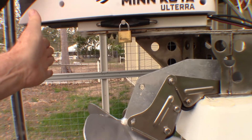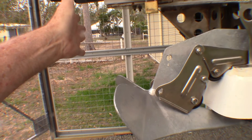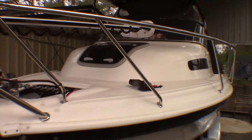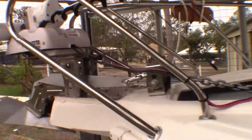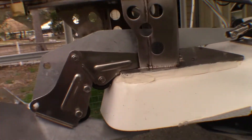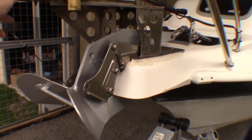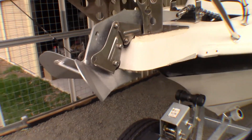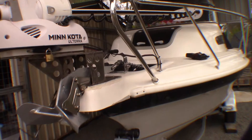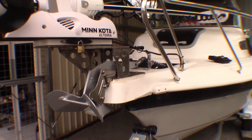If you went out to about there — out even further still — you could go straight out and still have room, although with a 72-inch the head here would be sitting real close to the hatch if you went straight down the middle of the boat. By going out a bit further you could run triangle gussets all the way out there, which would reinforce it a lot. I was happy to go to the side because I thought it was a better way to go.